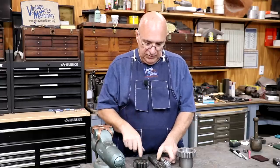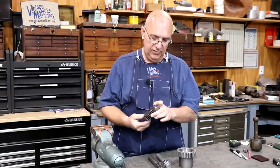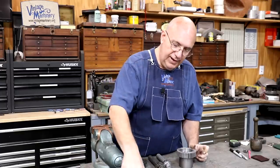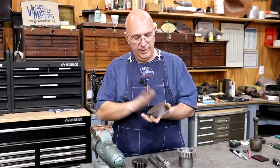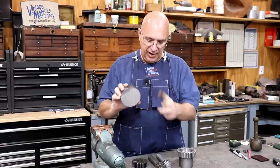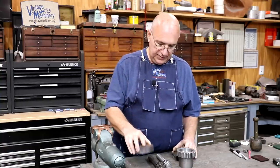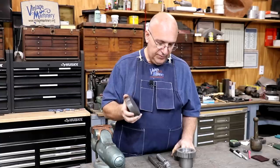I checked this material, and the original gear that's on here and needing to be replaced was originally made out of cast iron. I've got a piece of cast iron blank here — this is just some Durabar, one inch thick, a little over an inch thick, and it's a little bit larger in diameter than what it needs to be. We will machine it down to make it work, and that's going to be the game plan today: getting this last and final gear made.